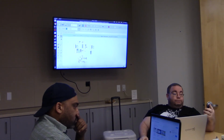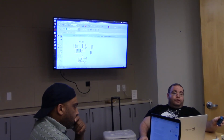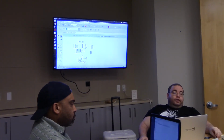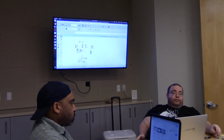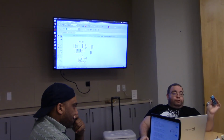Actually, before I talk about that, I want to talk about one more thing about this board. FPGAs are essentially digital devices. I can have an output pin set to either high or low, ground or whatever the voltage supply for that pin is, which is 3.3 volts on this board. So I need to turn a bunch of digital I/O pins into an analog voltage. The thing that does that is called, quite appropriately, a DAC, a digital to analog converter. You can buy discrete DACs that take in 6 input pins and output an analog voltage. You can also do what I did here, which is build your own with a bunch of resistors.